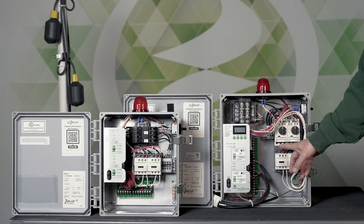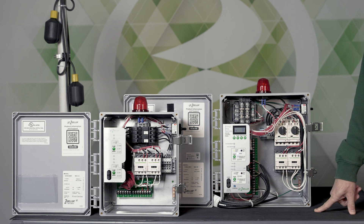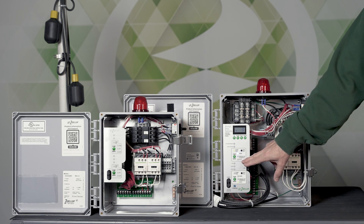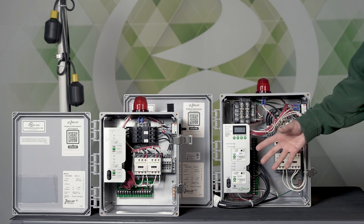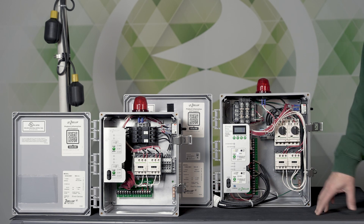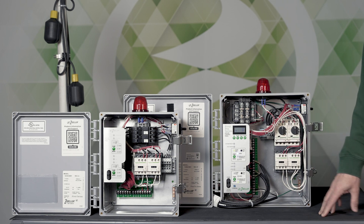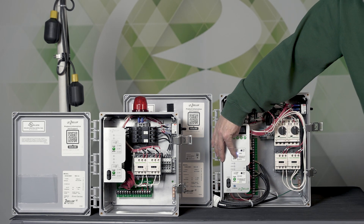The way we've set it up is that by default the pump running in hand will occur for five minutes and then it'll turn off on its own and return to auto. If the service tech wants to run it for another five minutes, they can just put it back in hand and turn it off when they need to, or they can go through the menu system and adjust how long that pump run time will be.